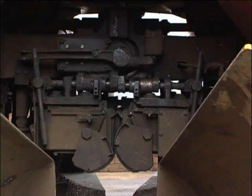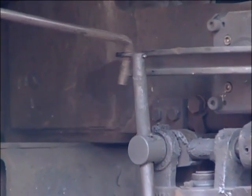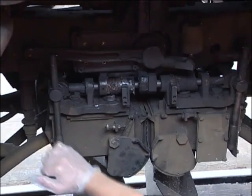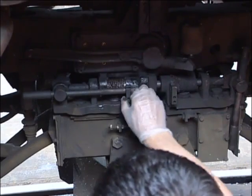In this condition, your train may only run at a maximum of 5 miles per hour to clear the main line. When you need to uncouple the defective unit, you'll have to use the emergency uncoupling rod. Because both electrical connection blocks are in the retracted position, both uncoupling levers are obstructed by the now vertical tommy bars. The solution is to reset one electrical connection block by pushing the tommy bar back to the horizontal position.